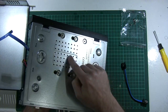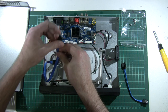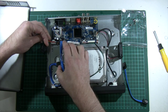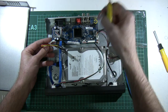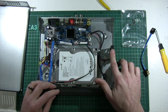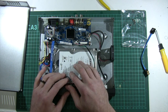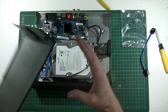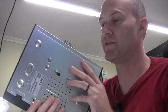Now we have our tiny single board Linux computer with its video acquisition hardware. There's the power cable for the SATA disk — the disk just plugs in and screws into the bottom of the case. It has ventilation slots and a cooling fan to get some airflow to the disk. Disks in these little devices can run quite hot since there's not much airflow — you don't have a big fan like in a normal computer.